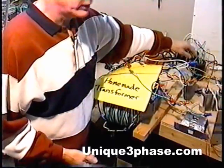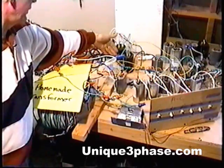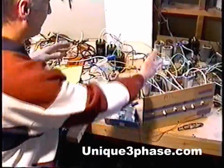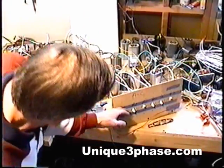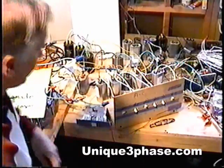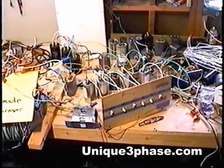There are some start capacitors over here. I have three of them hooked up because I was doing some experiments — you would not need three; one would probably be good for the air compressor. I have my capacitor board set up as I show people in the video. I've got a 48 microfarad permanently wired in, and a 10, a 55, and another 10. So altogether we have about 123 microfarads of capacitors.